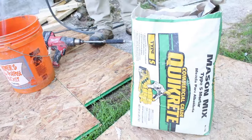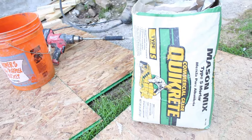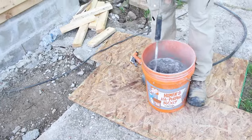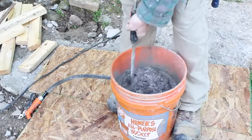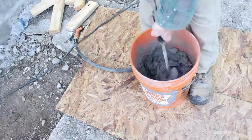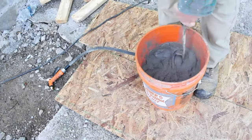First things first, we ended up using a masonry mix, Type S, because that's what the instructions called for — we always like to adhere to the instructions. We use the bucket mixer, which is a really great mixer we attached to our Milwaukee mud mixer. It works great for mortar, concrete, thinset, you name it.